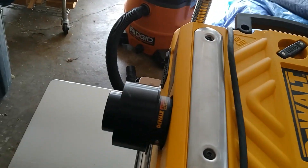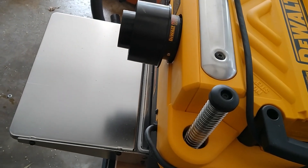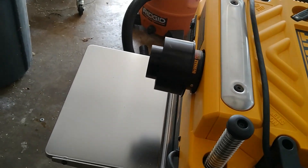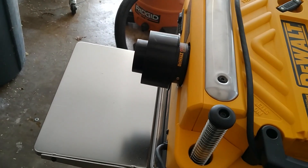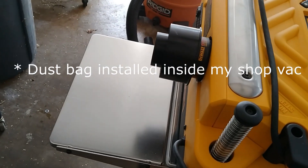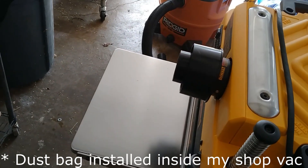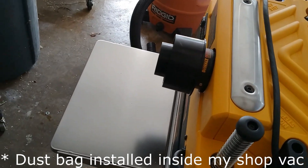So what I came up with is using standard plumbing to route the exhaust out to a hose where I can plug it into my vacuum. Since this thing already has enough power to push shavings out, I just plug it directly into the suction port on my vacuum and keep the shavings inside the vacuum that way. They won't get blown all over the place, because this fan is pretty strong. At first I tried running it through a trash can with the lid on — that doesn't work, it blew the lid off.